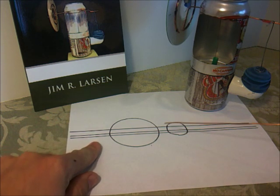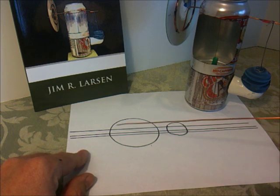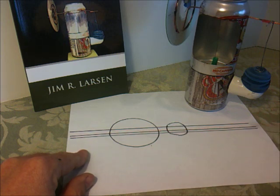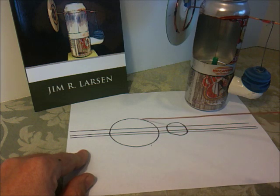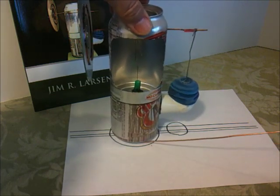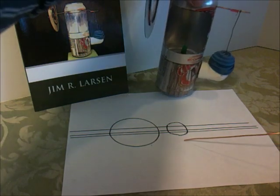I've made a template. The dimensions for the template are in the book. On this template the key things are these lines going across. This is the center line. The wider distance here is the size the crankshaft needs to be over the displacer in the big circle, and the smaller line is the distance the crankshaft needs to bend over for the end out here over the drive cylinder. I've marked the approximate positions using the engine as a guide so that I can see on my template how to bend my crankshaft and get it to fit.